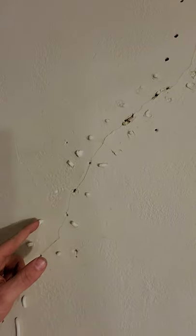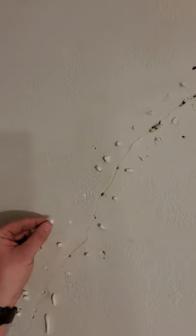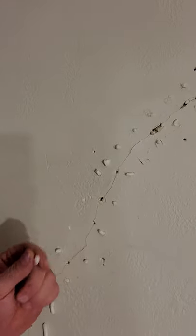So far I've done two tubes and I went through and filled each one of these holes. You can see where it's sticking out here because I have a series — I'll probably pop these off later. I'm using a series of washers, larger washers with smaller ones to fill in the hole, so I can use an inch and a half drywall screw to dig into the lath. And then I coated it with tape so that the glue doesn't stick to the tape — makes it beneficial so you don't have a bunch of washers all glued to your wall.